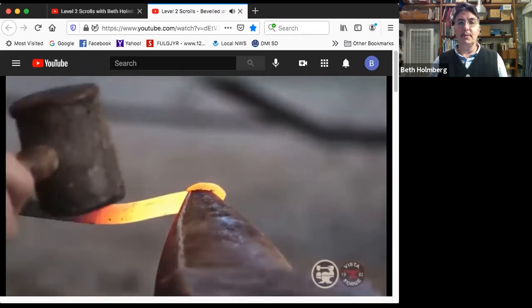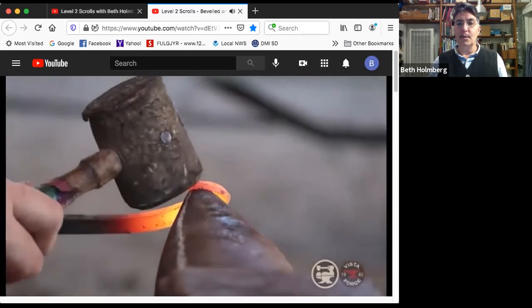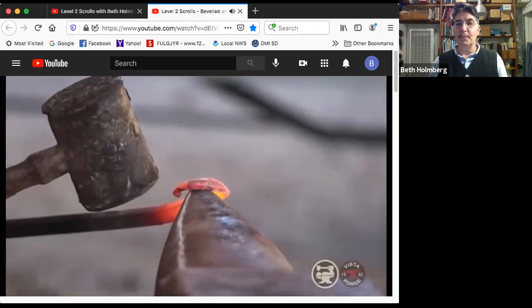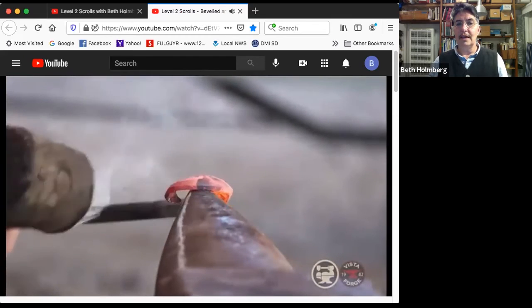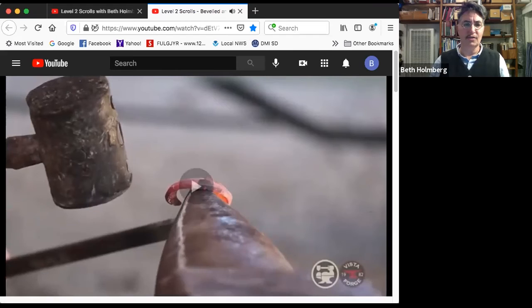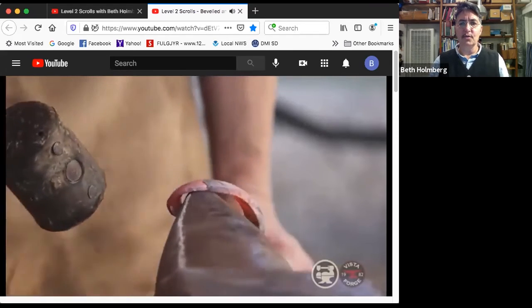So again, right from the tip, this is getting awkward. It barely fits on my horn anymore. Trying to get air underneath it is getting trickier and trickier. So I get it pushed out, adjusted square, and then I've got to get it rotated down. I'm getting it perpendicular, and then I have to make sure that it's lying flat on the horn here. So there's a lot that I'm looking after. There we go. All right, a little further on.